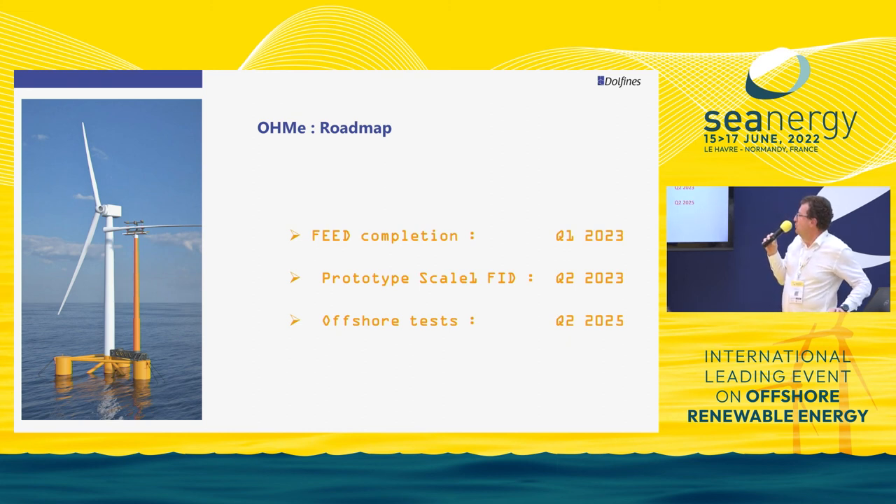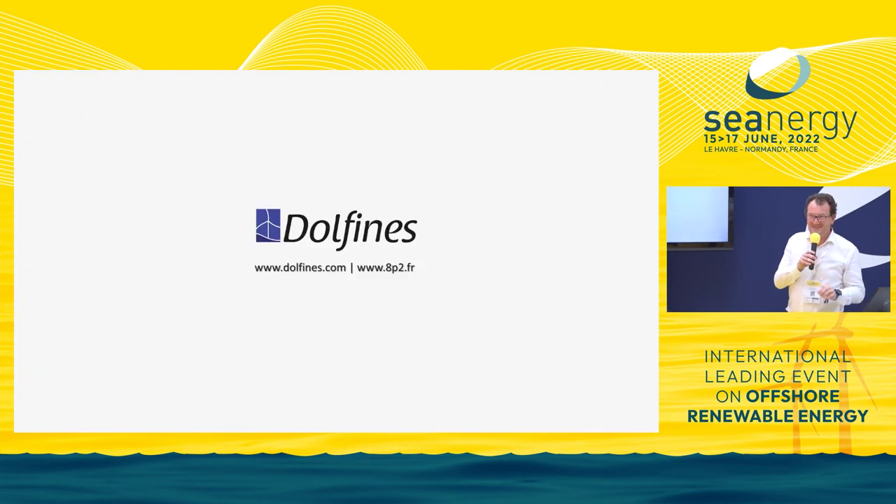This system was originally conceived for offshore repairs, but it can also be used on a jack-up to install or repair blades on turbines that jack-ups can no longer reach, since turbines are getting taller and taller. Having a jack-up with a reasonable crane and a telescopic tool could make intervention on bottom-fixed fields much easier and much cheaper. Thank you very much.